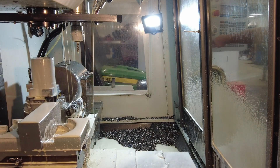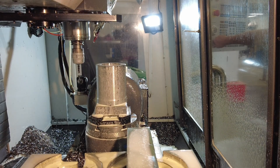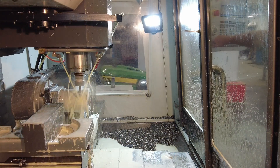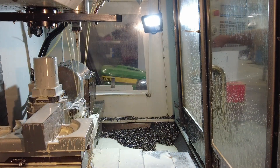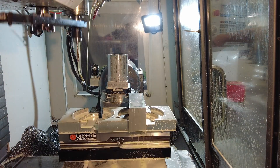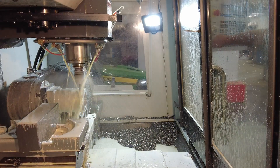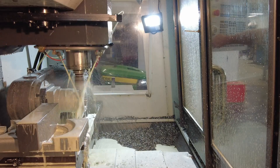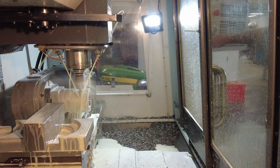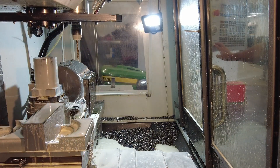This is an example of one of the things I haven't figured out yet. During this tool break detection I don't actually want the A axis to rotate up, but I haven't figured out how to stop that from happening yet. For those not familiar, the probing being done after the tool is used is to check if the tool broke during that operation, which in turn would stop the program before the next tool that needs to enter a feature that's not there.